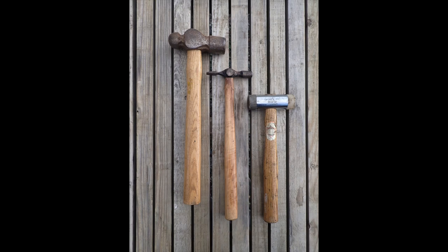As for hammers, I carry three in my toolbox: a lightweight FRP hammer for percussion testing FRP hulls, also known as the toffee hammer; a heavyweight hammer for barges and narrowboats; and finally a soft face hammer for hitting everything else where I don't want to leave a mark.